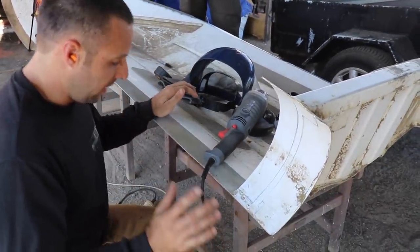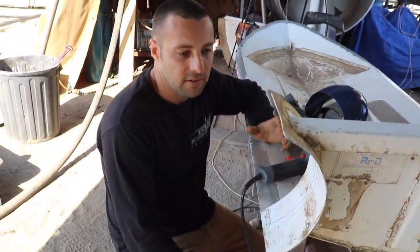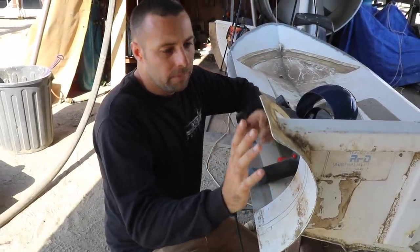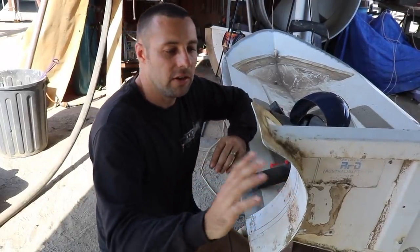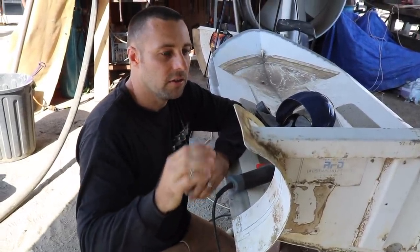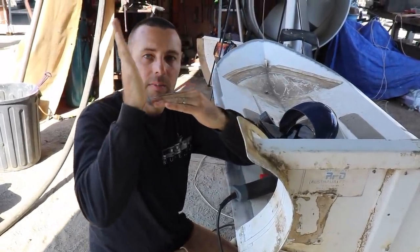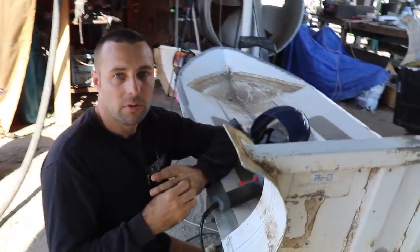So one of the issues that we have when you convert an inflatable dinghy to an aluminium pontoon dinghy like ours is you don't have the flexibility on the alloy that you do on the rubber. So these here are put in so you get lots of support for the transom to act as a stabilizing component, but also so that you can have the rubber firmly attached. There's big pads to glue on and all that sort of stuff. Now the issue is, when they make these, they make this square to the transom, but the transom isn't square to the boat. The transom sits on a bit of an angle, like this being the front of the boat, bottom transom. That's good for boat control and all that sort of stuff.